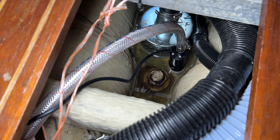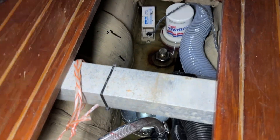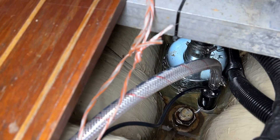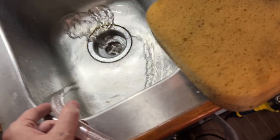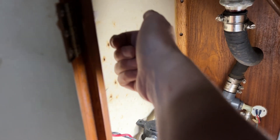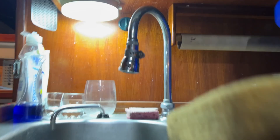If I've heard that 2000 gallon pump go off, I can come over here and there it goes. So that should get it down far enough that the float switch is not very close to coming on. Look how long it's running. Now there's no screw holding it in - it's just press fit behind the strainer for the manual bilge pump. Right now I have it just dumping into the galley sink. Obviously I don't want that long term. The other thing I plan to do later is put a manual momentary contact switch here so I could just lift it up, run it for as long as I want, and then let it go so I don't have to run back and forth to the breaker.